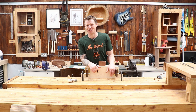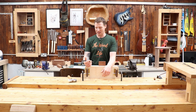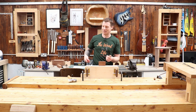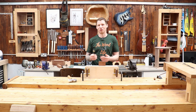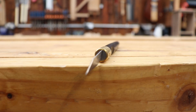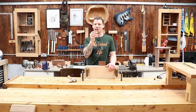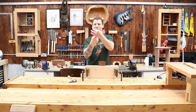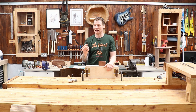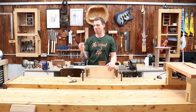Is there anything I don't like about it? Not really much. If I could change one thing - if I had to be really nitpicky - I'd get rid of the grub screw. It comes with its own allen key and I inevitably misplaced it. If the outer ferrule - the brass part - could be threaded so you could use that to compress the inside where it catches the blade, then you could get rid of the grub screw altogether. Just a slight twist to loosen, pull the blade out, put it in, and twist to tighten - kind of like an exacto knife mechanism. That would really take this knife to the next level with no tools required for blade changes.